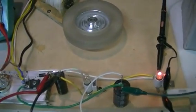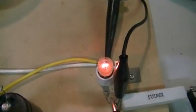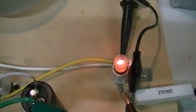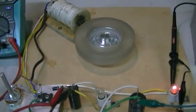Alright, thanks for watching. Next video, what we're going to do: let's have a closer look at what that bulb's doing. I'll take this little solar panel, we will put it in a light-proof box along with our globe, place a small resistor across that solar panel, put our scope on it, and we'll see if that bulb is actually pulsing. Looking at it, I guess it is not — and if it is, it doesn't have time to cool right down between pulses. I'll get this uploaded and let you have a look at it.